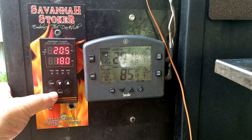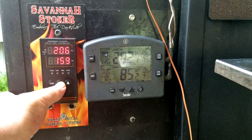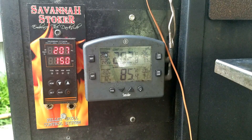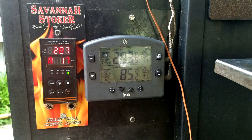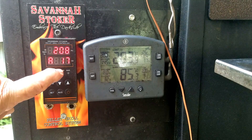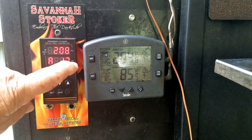We change the SV to minimum. In my case mine goes down to 150, which is about normal — it'll probably be 150 or 160. Next, press the set button to go to display 2. That shows the percent that the auger runtime is. We have a default cycle of 20 seconds and the auger is running 17 percent of 20 seconds.